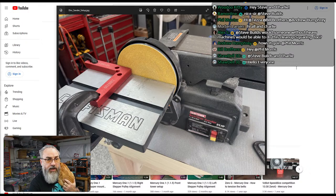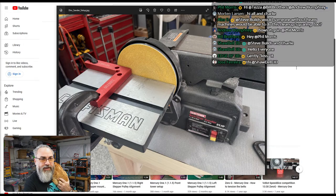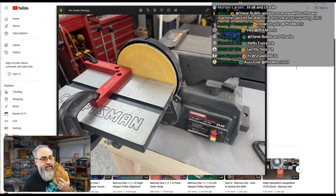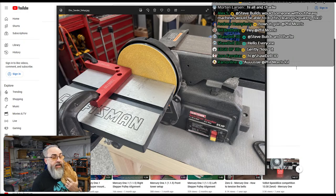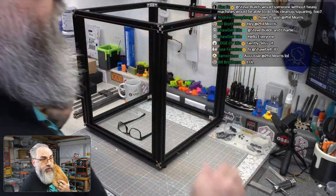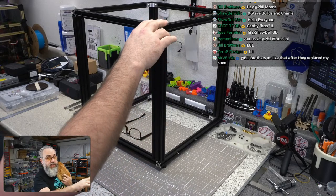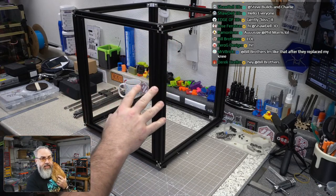When making do with this setup, I try to be very conservative with pressure since it's not a super rigid or sturdy setup. I took very light pressure and a little extra time — if I pressed too hard there's deflection, so I found that barely pushing the extrusion into the disc gave a better finish than rushing it. After doing all the frame pieces, I brought everything in, checked with my square, everything was coming out pretty darn square, and assembled the frame.